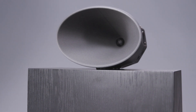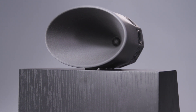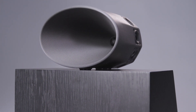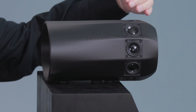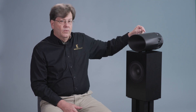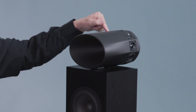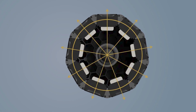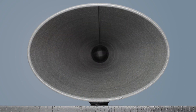The point array mimics the point source because it is an array of nine drivers in a ring, with no boundary from one driver to the next — they're continuous. In its geometric center, or point, if you will, which can be determined by taking the axis of all nine drivers — they would converge on a point, and at that point is where the tweeter is.